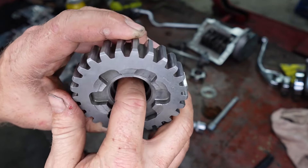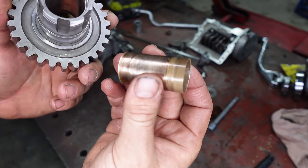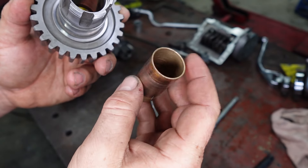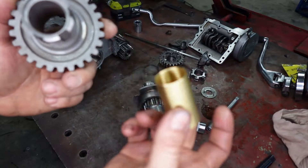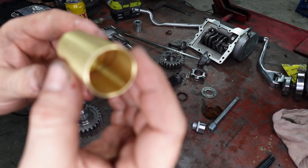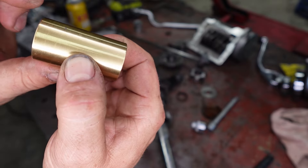I've just given this a clean up, so this is like a brand new top gear — it looks super nice in there. So this is our old bush. The thing stinks — you can tell it's been in there for a long time. The oil sits under here and gets really stinky because it's a mineral oil. But this is our new bush. When you look at these new bushes, see this one has these little grooves cut in it — that's to hold the oil.